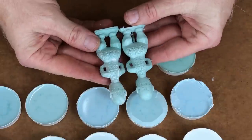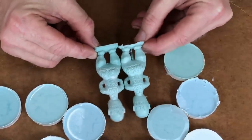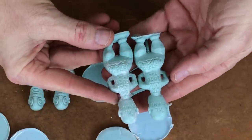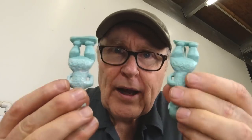I'm still a hair light, just a hair light. I don't want to be light — if anything I want to be just a hair darker. So let's throw in one more and give it another shot. So we're pretty close. This is the third color test and we've made a casting each time, just putting a little bit more stuff in there every time. Should be pretty close now. Yeah, it's pretty close. It's close enough — I would call that a government job. Here's our sample boy and here's our copy. I think we've got the color pretty knocked. Let's do a test batch and see what they look like.